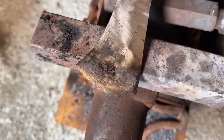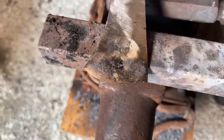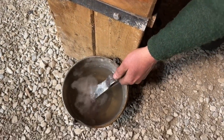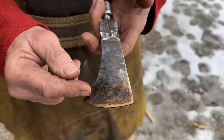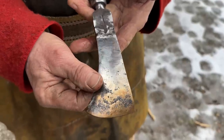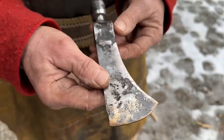That's just starting to turn a gold — it'll turn purple if we leave it any longer. We'll put that right in the water. Chris and Bo have worked their magic, and we've got a beautiful bronze-yellow color right out to the cutting edge, so it's tempered well. Now a whole lot of filing and finished work, and that's going to be a fine piece.